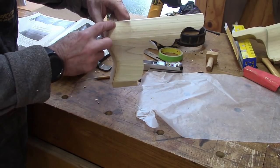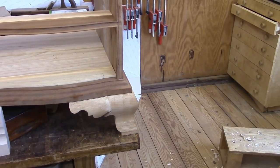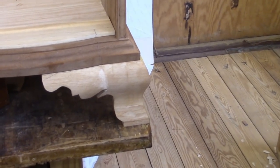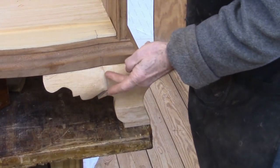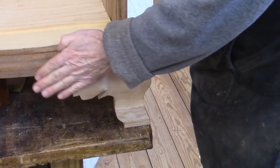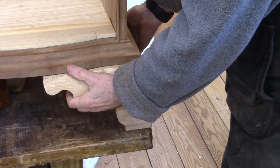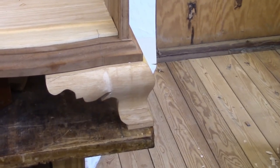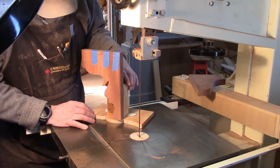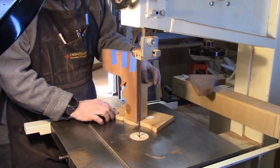Here's a template of the shape — they're six inches high and rather long. This is the side, so it's straight in the back; the front is thicker by about a half inch, so this is one inch and this is an inch and three-eighths. They're mitered to the back corner leaving about three-eighths of an inch of extra material that has to be carved off. I've got the first practice foot made, but it needs to be a little more curvy — this area doesn't come out as far as I'd like, so I'll need to add more material and try again. I've got the foot mounted on a device to keep it perpendicular to the tabletop so I can saw out the curves.